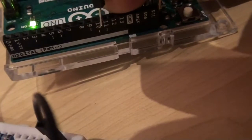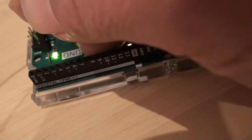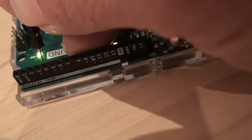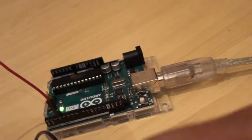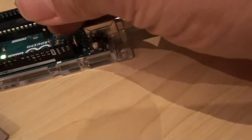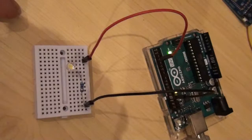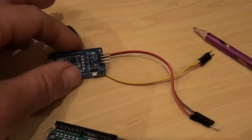You can tell which pins are PWM - they're the ones with a tilde symbol. I've chosen pin 3. If you don't use a PWM pin, all you can do is turn your light on and off at full brightness or no light at all - like pin 4 for instance. I'm using PWM pin 3. Make sure you put the red lead into the positive supply and the black lead into ground (GND). That's how the LED circuit looks.